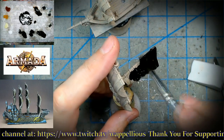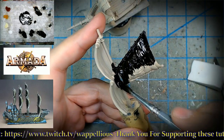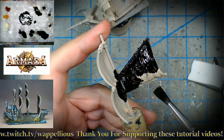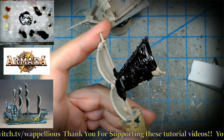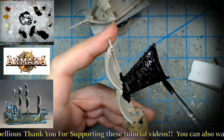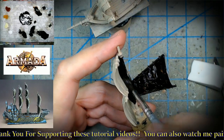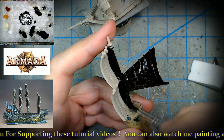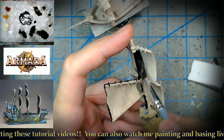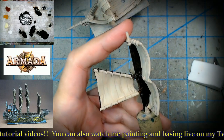There's another property to consider with pre-glaze: the staining property. When we put this color on and then wipe it away, how much is left behind? The more staining a color is, the more remains. This is a mix of asphaltum and a little van dyke brown — which is a reddish brown — then the van dyke brown alone is more neutral. Things have evolved over time; what used to be a very watery pre-glaze is now a little less so.